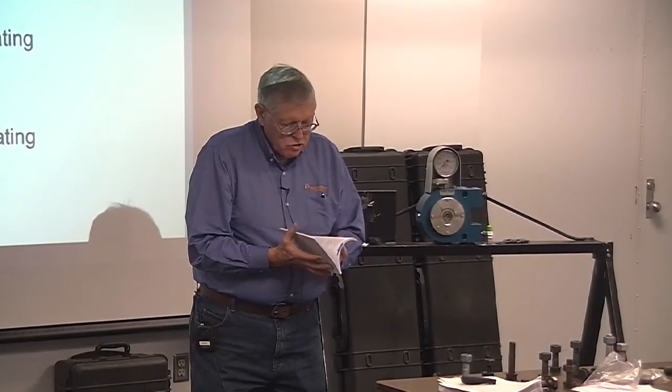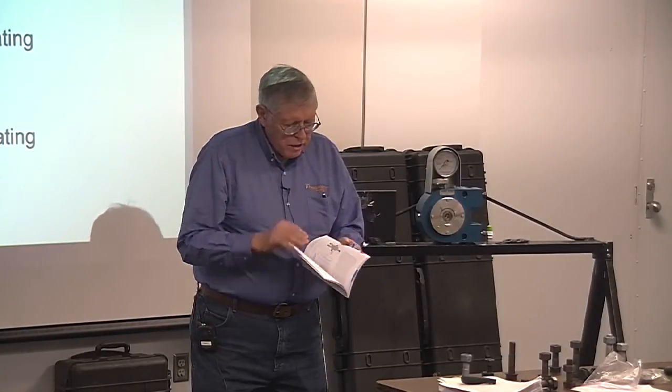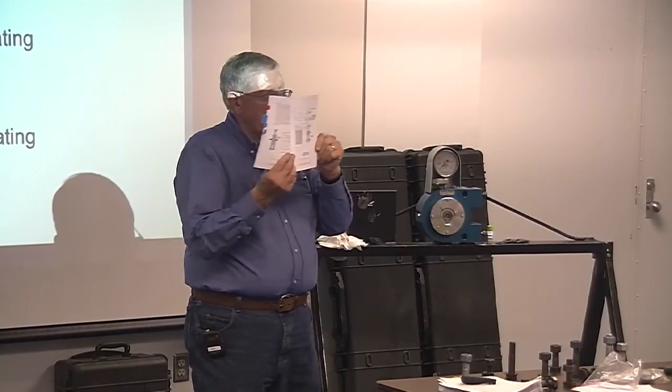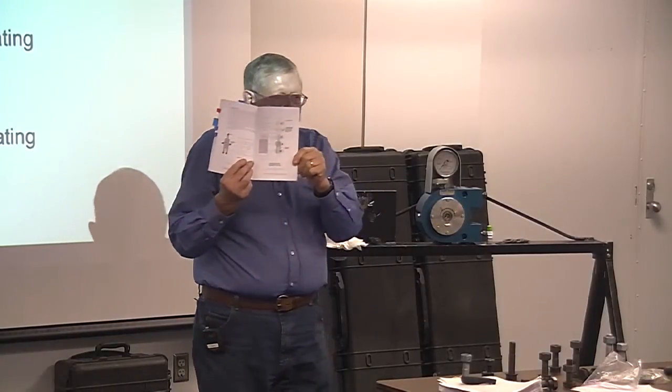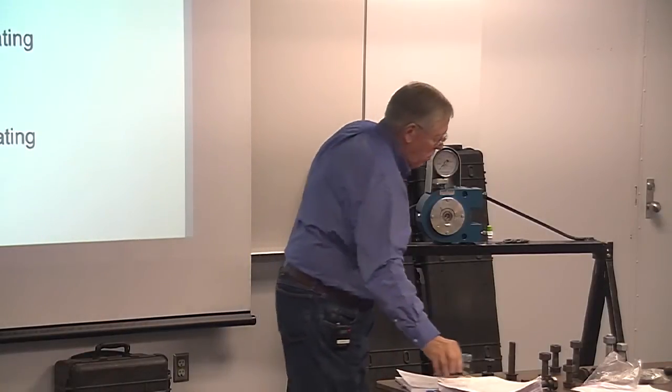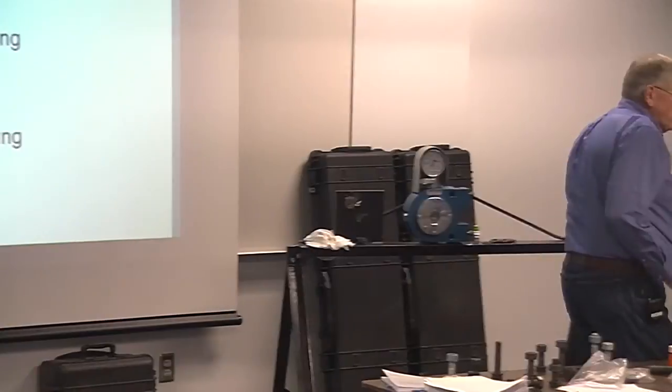In the back of this Research Council spec, there's drawings illustrating how they test them, what's required. There's a procedure for doing that test in the Research Council spec. But they have to test the paint in the thickest condition that's allowed in the design.